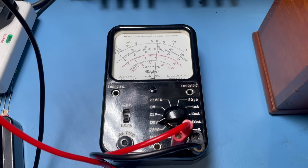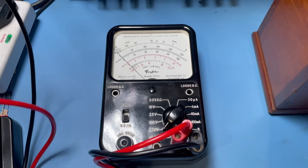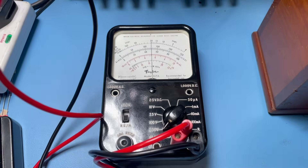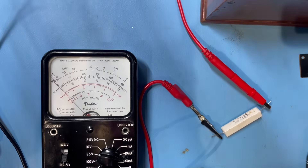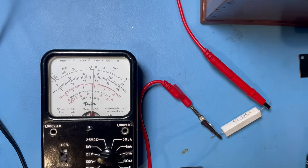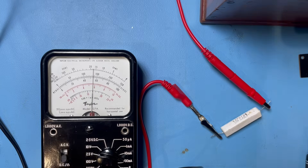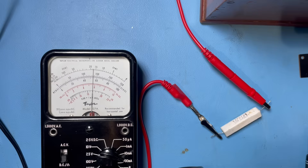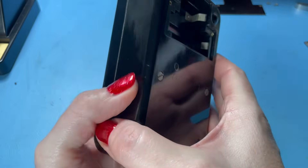Pretty spot on! Let's go on the 250 volt range and give this 120 volts DC — okay, not bad. Let's have a quick play with some current. I'm on the 100 milliamp range and going to hit it with 50 milliamps. It says read the 0 to 100 scale and divide by 10, so 50 would be there — we're not far off. Let's take that down to 40, 30, 20, 10 milliamps. Okay, not bad!